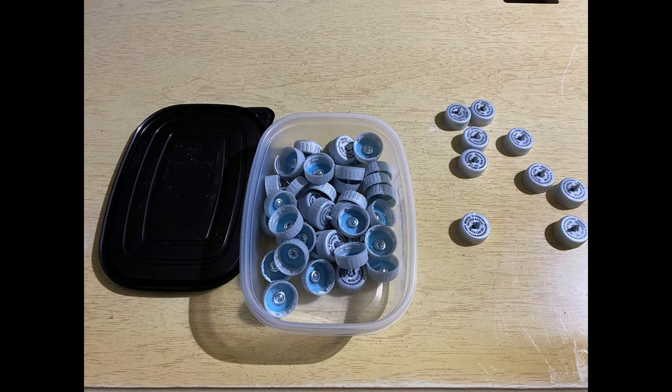Hi, I wanted to make some point stands so that I can save some time when I'm finishing an item. I can apply the finish first to the back or least important side of the item, place it on the point stands, and then work on the finish on the top. And the back then can dry with minimal impact on the quality of the finish on the back side. A real time saver.